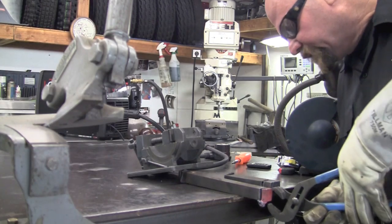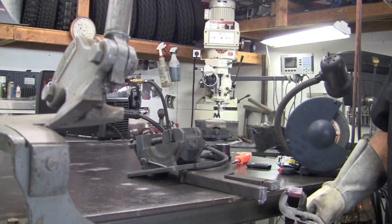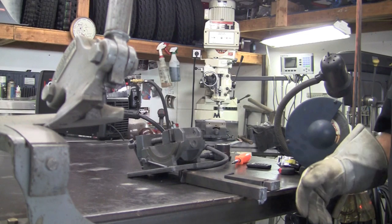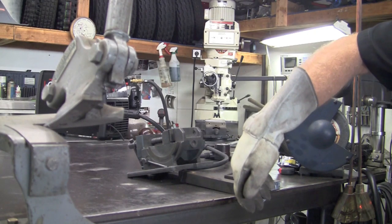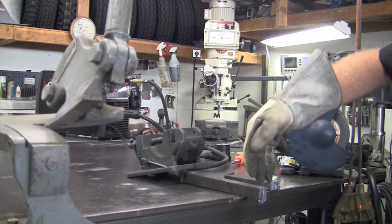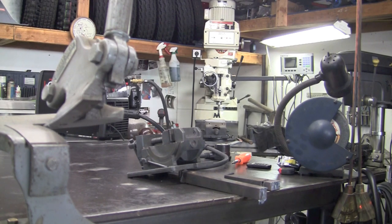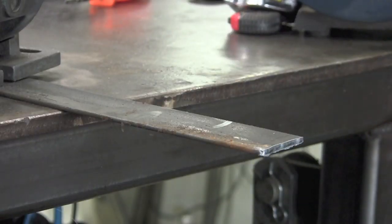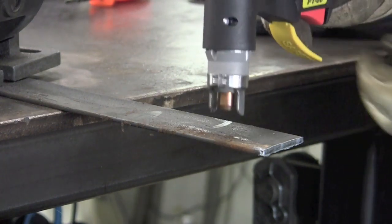We have just the smallest piece of dross or slag hung up here on the end — go ahead and knock that off. That was more of a technique issue: when cutting something thick, you want to come in at a torch angle and pierce the lower part first, then straighten up and come across your part. As you're getting to the end, tilt it again to get down on the lower corner. As you can see, this is a 40-amp machine that just cut through one inch — amazing. Here's something more appropriate: this is some eighth-inch 1010 hot-rolled steel, machine set on 40 amps, which is more like what I would do in the shop.